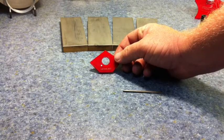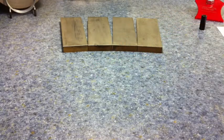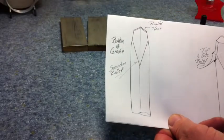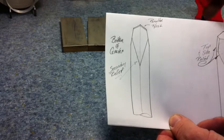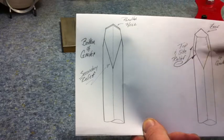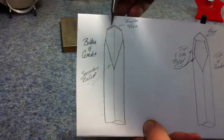This template grinds all your clearance angles for your top and your bottom. This is the bottom of the graver as you're looking at it after you've ground it. The bottom V that you'll be riding on on the table grinds this secondary relief, which gets metal out of the way so it doesn't drag when you're cutting. The larger template will put this heel on it — it's a parallel heel all the way across.